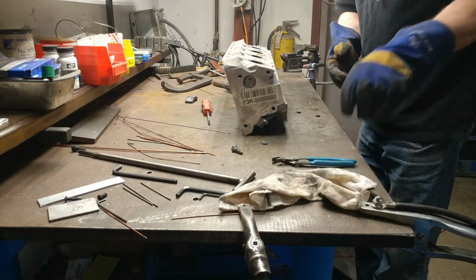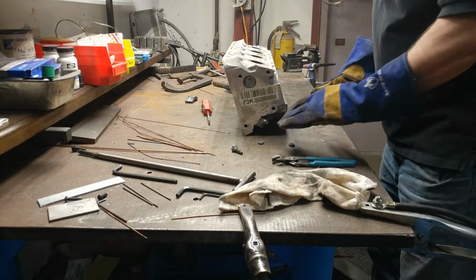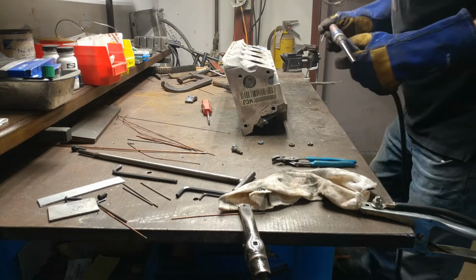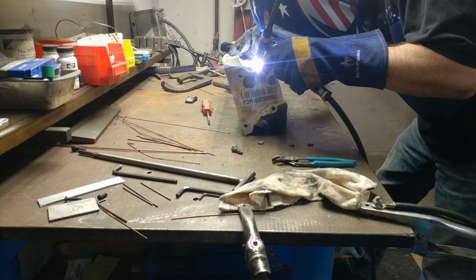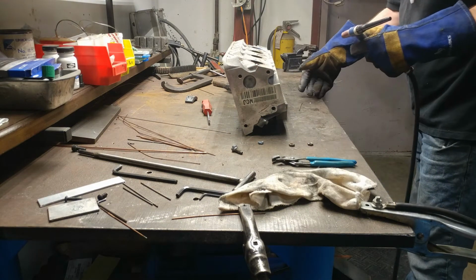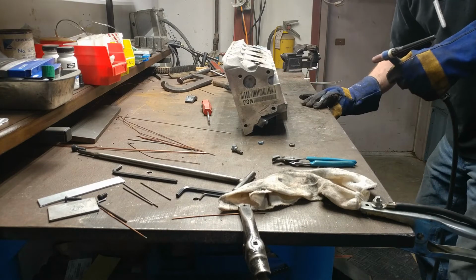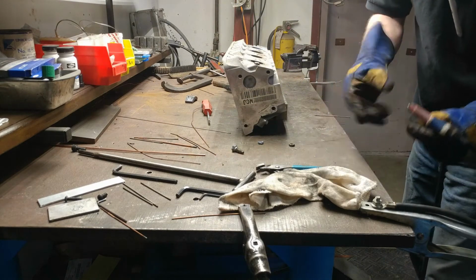Number one. Now these next two are going to be more difficult because they're flush. So what I'm going to do, try to build them up a little bit beforehand, and then drop the nut on and zap her down. Thinner rod, easier to get in place there.